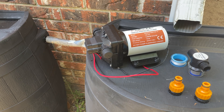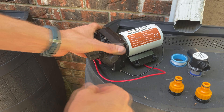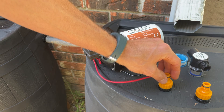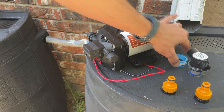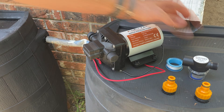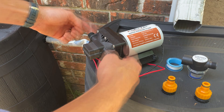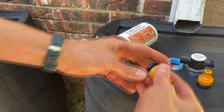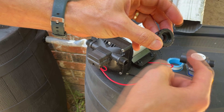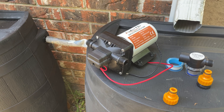Here's the pump we purchased online — I'll link it in the description below. It came with a couple of different hose connections which weren't great because every time I tightened them the rubber washer inside would collapse and partially block the flow of water, so I decided to use PVC. It also came with teflon tape and an inline filter, which is really useful. This is a 12-volt pump made for RVs and campers, so it contains a built-in pressure switch to tell the pump to turn on when the faucet is in use and off when it's not, which will work great for our rain barrel system.